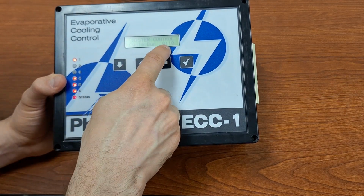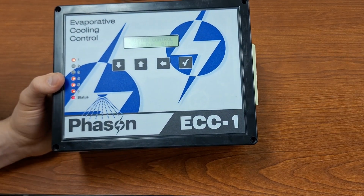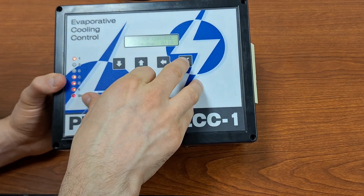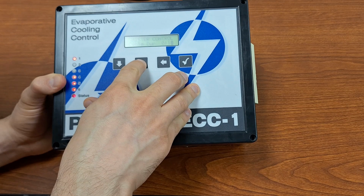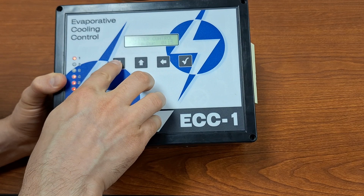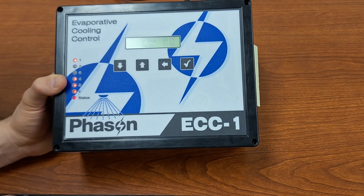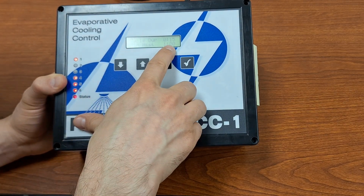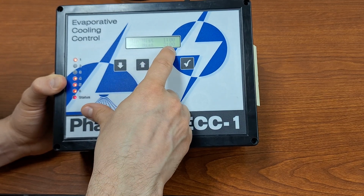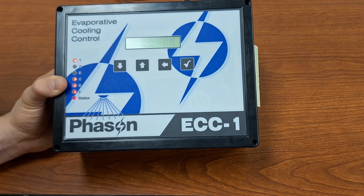We are going to have our cycle duration. And again, remember, now that we're in misting and fogging, the cycle is going to stay static. So right now, let's do maybe a 15-minute cycle time. Then our misting duration, that is what is going to vary. So our minimum misting is 1 minute. That works okay. Maximum misting of 2 minutes. That also works okay with what we've got.